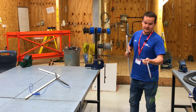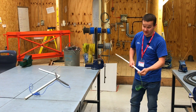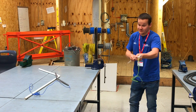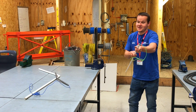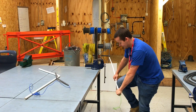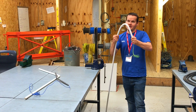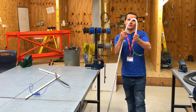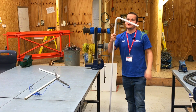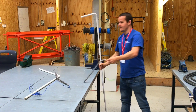This is probably twice the price conduit, but if you're doing bends it's going to save you money. Let's hope it works — warm it up, then go over your knee and bend it. See the difference — the conduit is keeping its shape, and it springs back to a 90 degree for you. There you go.